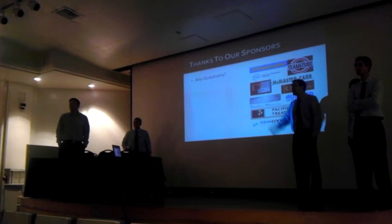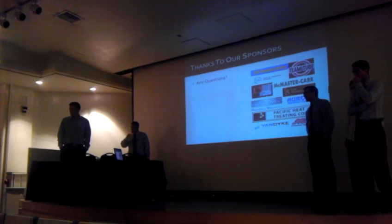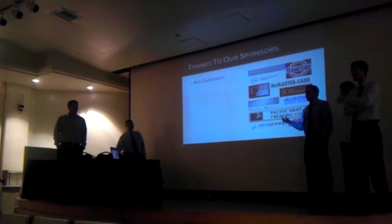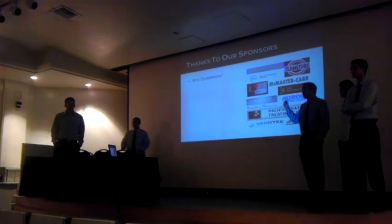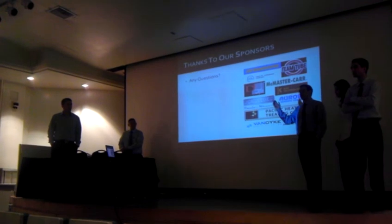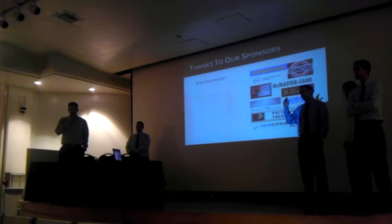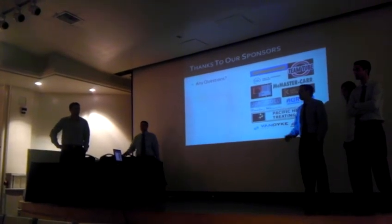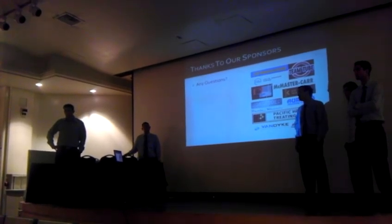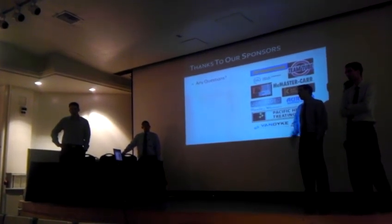You mentioned that the material dimensions changed from design to manufacturing. That was actually based upon the fact that in the state of California, it's really hard to get specific tubing in a short amount of time. We did hit our manufacturing targets as far as making sure we got material here to build over winter break. But because we specified a specific OD and ID, it was not available on the West Coast in time to send it to the laser notcher down in Southern California and get it up here in time to move forward. So we abandoned that idea and went with the rule-stated structure. It came out pretty much a wash.